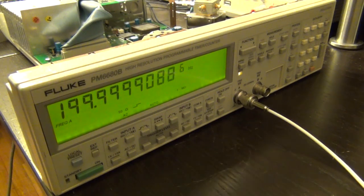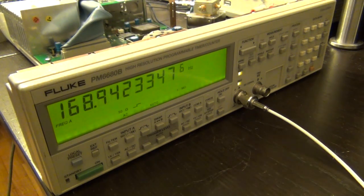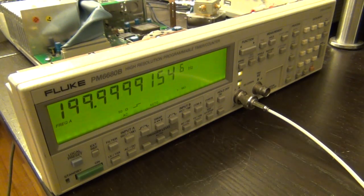So it's right now at 0 dBm. Let's go to... No, that cannot do that. There you go, minus 16 dBm is fine. Minus 17 dBm is good, minus 18 is good. There you go, minus 18 dBm, give or take a little bit because of the loss in the cable. It's okay. You can measure pretty small power values as well, and it doesn't do a very good job at minus 18 dBm, but it looks like at around minus 15 dBm, you're going to get a pretty stable reading. So 199.9999 MHz. I think it looks good.